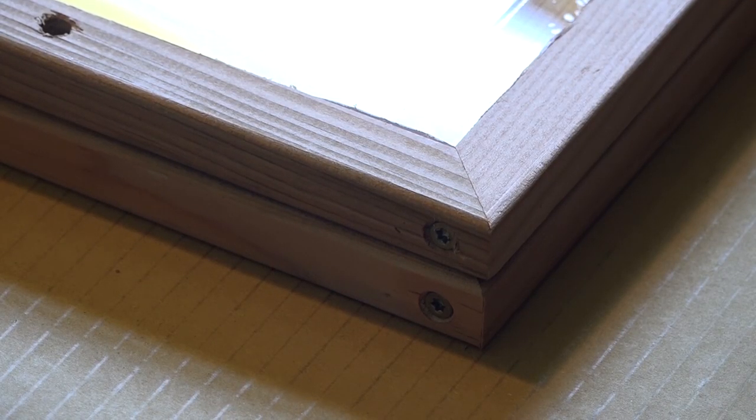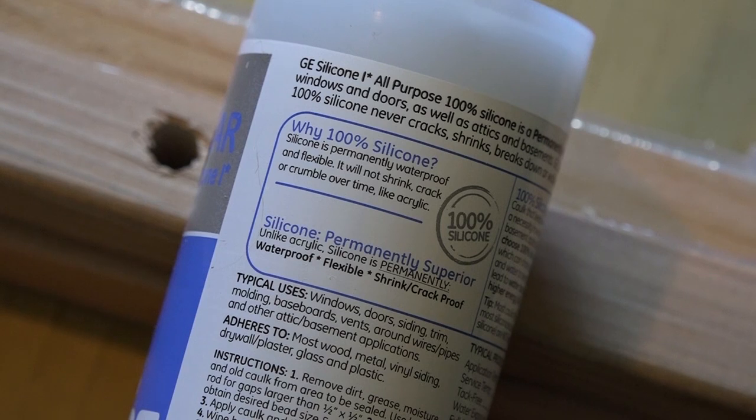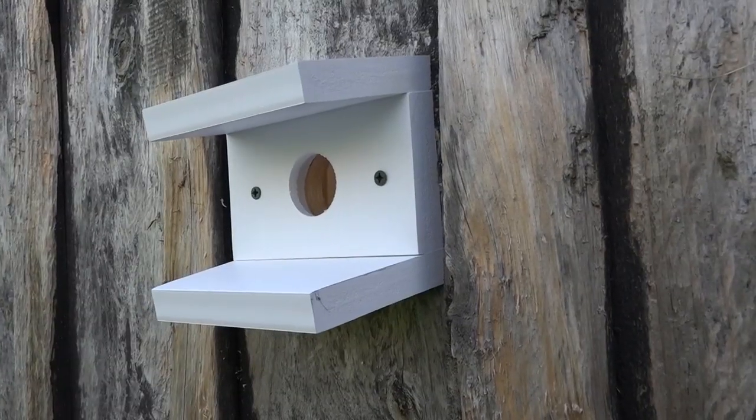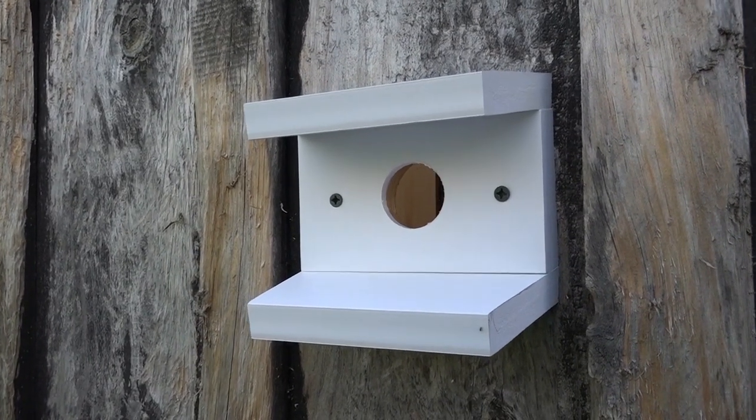You have the option to finish the woodwork on the exterior. I wouldn't put any finish inside — just leave it plain, which is what I'm doing. The silicone I used is 100% silicone: totally stable and inert once it's dry. Make sure you have plenty of ventilation when using it. Once you've bedded the plexiglass in silicone into the frames, give them at least 24 hours to cure.